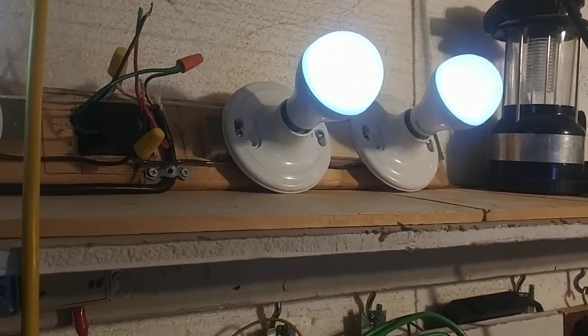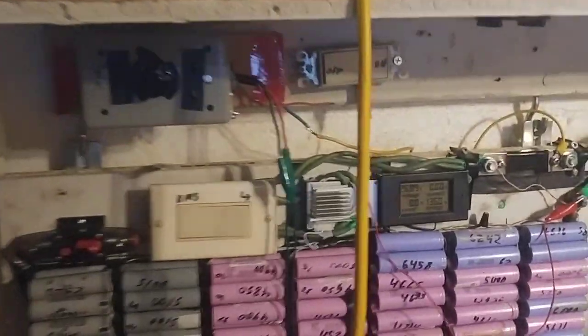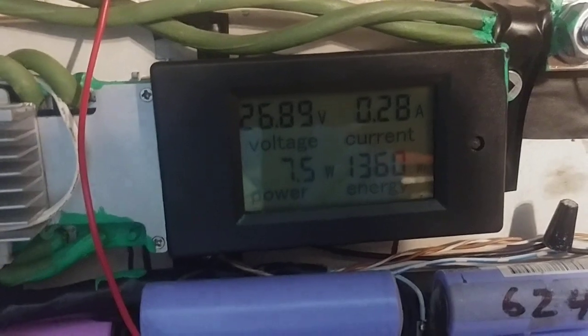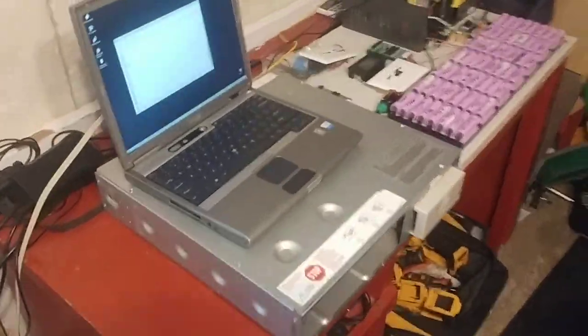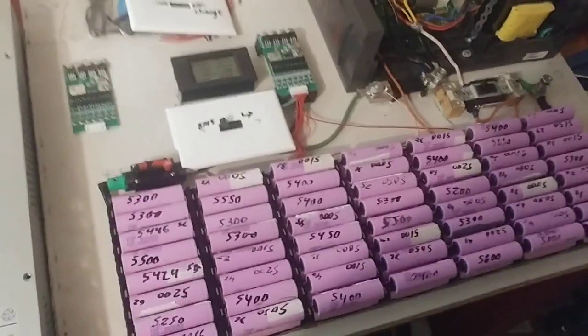You can see the blue — it really comes out in them. But these are more for working light. If you're in a living space, you don't want cool white, because the blue light kind of hurts your eyes and it's not good for winding down and going to sleep. You want warm light for living spaces; this is good for working environments. It's dimmed all the way down, and it ramps up — at most 36 watts. So 36 watts versus these guys here — just these three crappy light bulbs are consuming 75 watts. That's why I'd recommend getting these DC LED light bulbs and running them straight off of your power wall — much better bang for your buck. This APC thing, at most, is good for running microwaves and your computer.